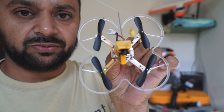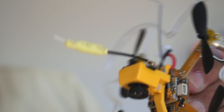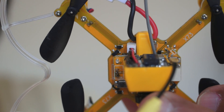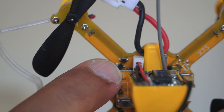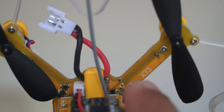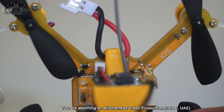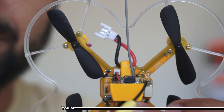But it has one major flaw — let me show it to you. This is my first Eachine X73 and I had a problem, so I asked for a replacement. If you look at the back side here, you will find some tiny black electronic components — I'm not sure if these are ICs or what — which have something to do with powering your corresponding motor. But you can see on this side there is nothing; they are gone. The soldering was so disappointingly terrible that upon one bad crash, those components were gone and this motor stopped working, making the quadcopter completely useless.